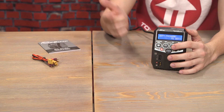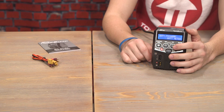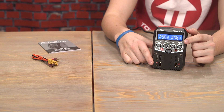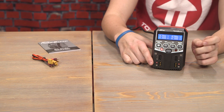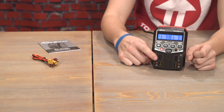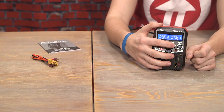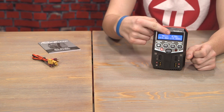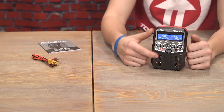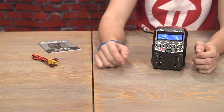And then there's also a PB battery — you can charge that as well. Next is a battery meter. We're going to click Start or Enter on this. This gives you a voltage readout for your lithium polymer cells. Anything with a balance lead — a LiPo, LiPo-HV, or Li-Ion — you can plug into the balance port right here, and it'll give you the voltage readout of each individual cell. If you click the Increase button, it gives you the main voltage level — the overall voltage, plus the highest and lowest voltage. Essentially, it's a cell checker without having to start charging, so you can see what it's reading at.